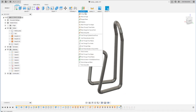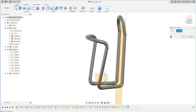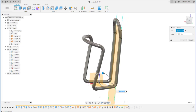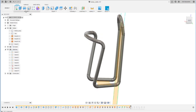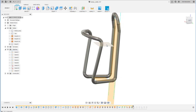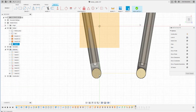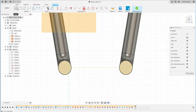Before creating the plane, I create two axes and then a plane parallel to this axis. I create another plane perpendicular to the previous plane, then offset this plane to a certain position for my sketch. I use Slice and create a projection from the port of the wire on both sides, then create a line connecting the two circles with a tangent constraint.